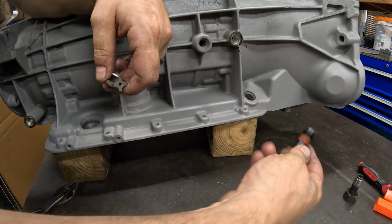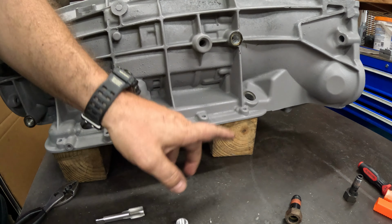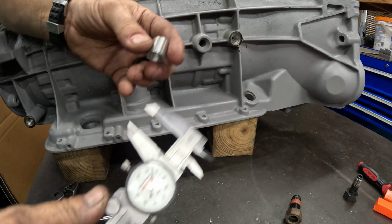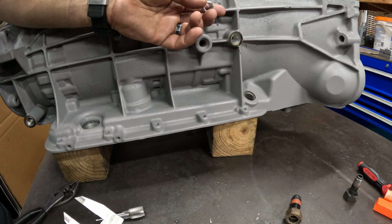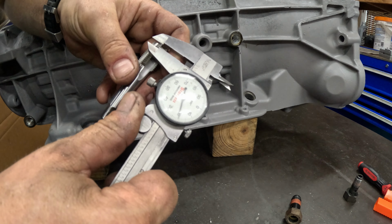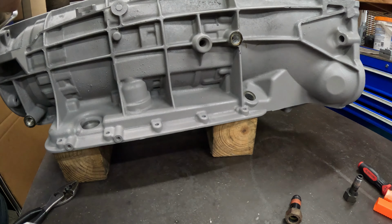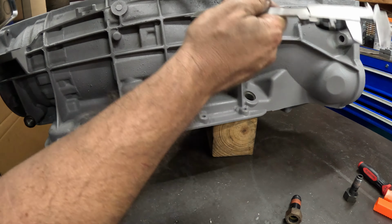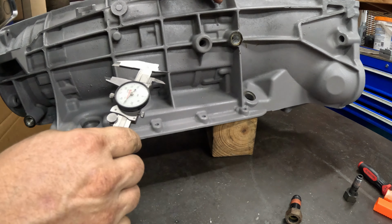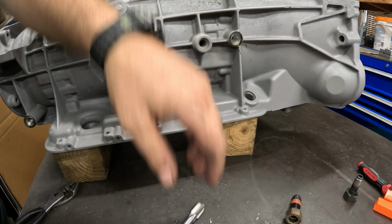in between the washer and the case. So I gotta add everything up. I have 840 in there. I have 700 on this. That's gotta be recessed 100 thou, so there's 800 there. And then I got 200 thou of tap length that I can't use in the bottom, so that gives us an inch. So if I have 840, and actually 830, and right now I'm at an inch, I gotta take 170 off of this.